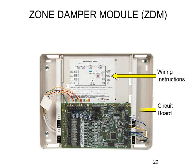Damper systems themselves are four zones. On the left-hand side is where you wire your dampers; on the right-hand side is where you wire your temperature sensors. If you use the smart sensors, they're communicating over the ABCD wire and you terminate them on the top two terminals, which are identical — just giving you more space to land your furnace wiring and zone sensor wiring. To expand to eight zones, you get a second board that snaps into the top half, giving you four plus four for a total of eight. On the second board, you just tell it that it's zones five through eight.